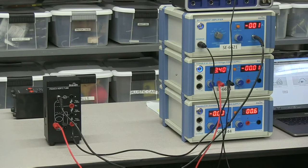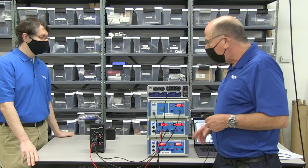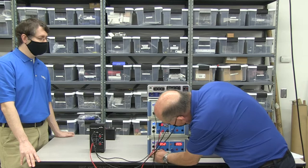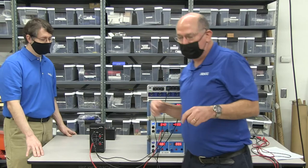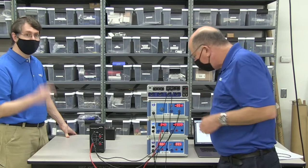I've got four different voltages. The important one is the one I'm going to adjust from zero to 85 volts, giving electrons more and more energy as they accelerate down the tube — that's what we want to read. The other ones we can pull off the box. There are two connections: the lower one goes zero to 100 volts, and there's also a zero to 200 range. This tube says it can only go up to 85 volts. You definitely don't want to go above that because you risk damaging the tube. I put that into Source B because the Capstone file is configured for that.